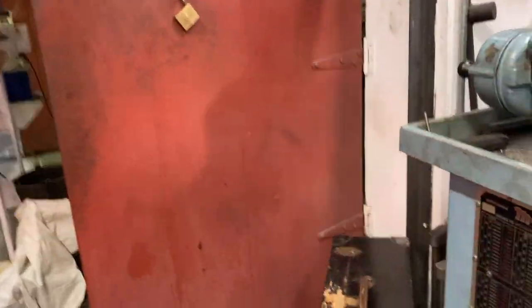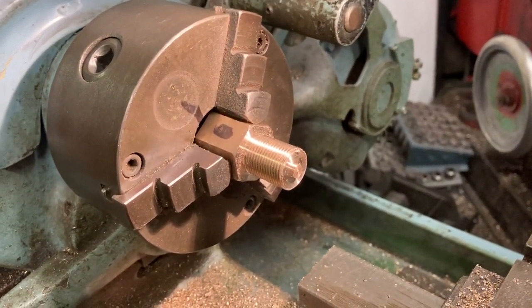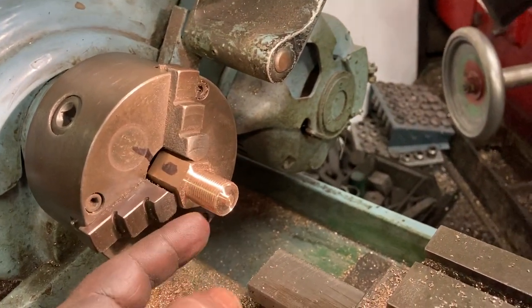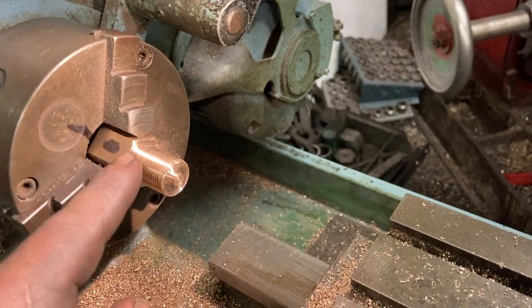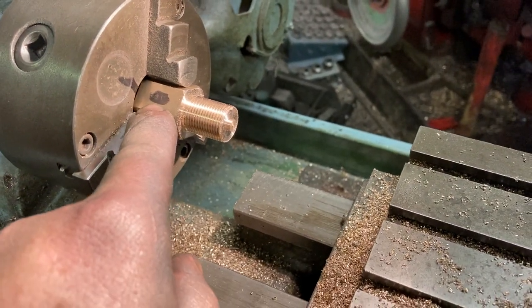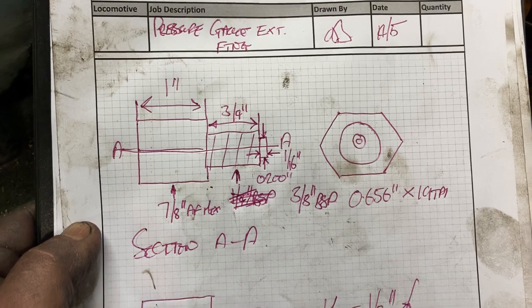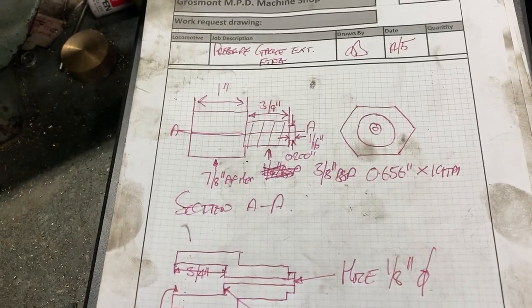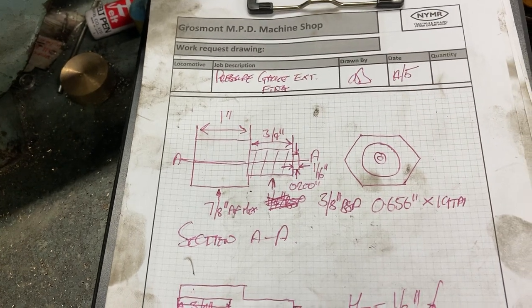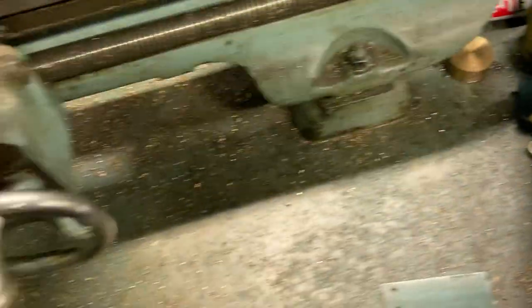Another quick job that's been requested is this little beautiful thing, which is going to be a fitting for the pressure gauge that goes onto the boiler shop's test rig. It's basically an extension, because the pressure gauge they're using doesn't quite fit properly physically — the threaded connections are fine, it's just the body of the gauge is slightly too big. So just taking a lump of bronze, put a hexagon on one end, machined a male thread onto the other end, and then that hexagon just needs drilling and tapping, and an eighth-inch hole drilling through the middle of it. When it's finished we should get something that looks roughly like that. Incidentally, if anyone looking at that drawing can hear a distant rumbling sound, do not be alarmed — it's just a distant ancestor of mine who was Chief Mechanical Draftsman at Horwich Works, turning in his grave when he sees that. Very sorry.